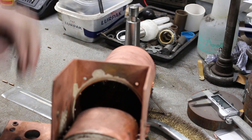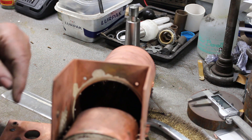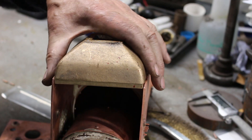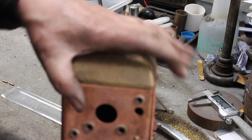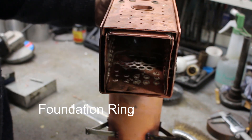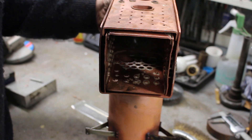There are three silver soldering jobs left, two of them pretty major. The first is to silver solder some stays into this portion of the boiler which I haven't made yet — so that's the next job. One of the major ones is silver soldering the dome, which doesn't fit anymore, and also putting on the back plate. Those are two jobs that are going to need a considerable amount of heat. The very last job will be filling in the gaps around the bottom of the firebox, which I think will be one of the easier jobs. Then that will complete the boiler, apart from the hydraulic test. Thanks for watching!